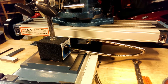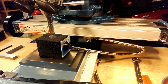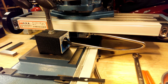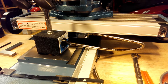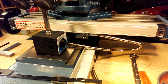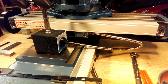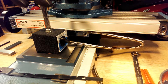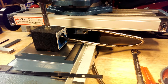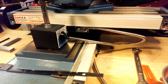Here we are looking at the table from behind the mill, in the same location that the head and column would be. As you can see, I have the screws — M6 by 30 — drilled into the top of the table to mount the scale. When pre-mounting the scale, you want to make sure the sensor can travel the full width of the table, because you're going to mount that sensor in a permanent position.